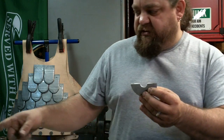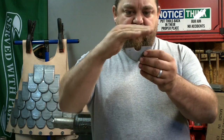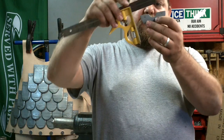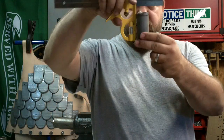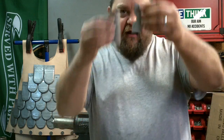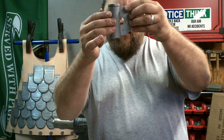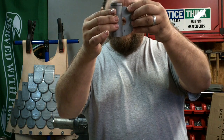Also, after cutting, I'm still learning to do the portable band. I did pretty good actually cutting on these, the lines, but I did have a little bit of waviness, so I took them over and used the square to level this out on the 1" by 30 grinder. I set them against here, saw where my high spots were, sanded a little bit. I put a 40 grit paper on there to make quick work of it, and then everything's nice and flat so that I don't have big gaps when I'm trying to weld. I want to get as good as I can there.